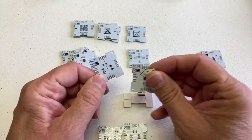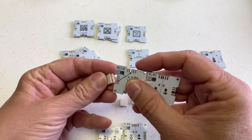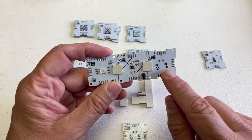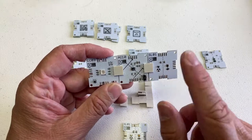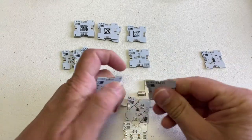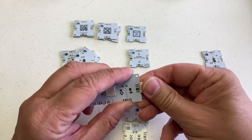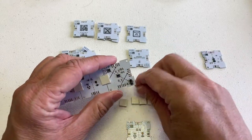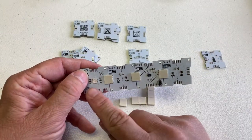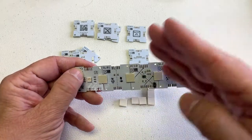Let me demonstrate. If I put this address selection chip in between my core, I now have a core and an address selection. Let's say there are two sensors on this — the one before this was 3F, now it would be 4F. If I connect it straight like that, it will have a 4F address. If I connect it with 3F address, and then I put another SL01, I can now address them both from here. Because this circuit — the arrows show that whatever you put on that one side gets its address changed to the other side.